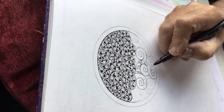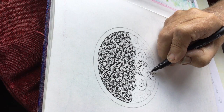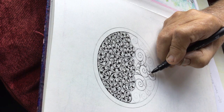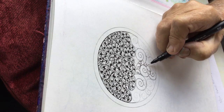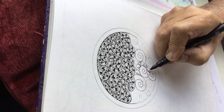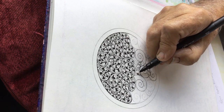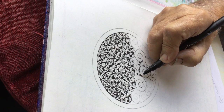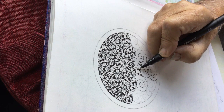I've got another one coming this way so I will do that there. I've already given the indication with my little drawing in pencil first to give you the example, so I'm not going to interfere with this one — I'm going to go around. I'm starting again here, doing the short movement, keeping this stem going here, so it's short, round there. I will fill this in so I didn't want too much cutting away. I'm giving you a quick demo on this video to give you the example of how it would go. We will cut this away with a graver — I'm much more comfortable with a graver than with a pen in this style.